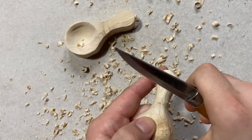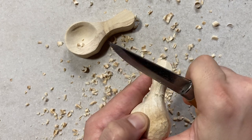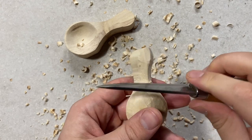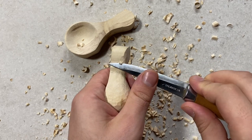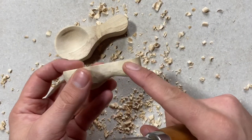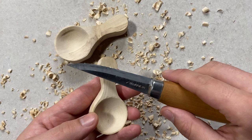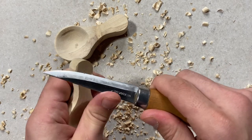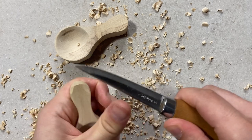As before when we were carving that initial dip, because we're starting to go back uphill use that twisting motion, then reverse it and take tiny amounts — just as we did when first carving that dip. Be careful you're not going too far into the wood when you reach the point where the grain is lifting. Now I'm carving the top of the handle — I'm pretty happy with the rough shape of the bottom and I want the top to dip down just a little bit. Exactly the same way we carved the base, I'm carving away from myself and just dipping it down.